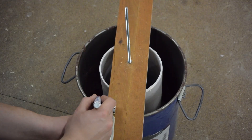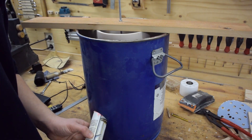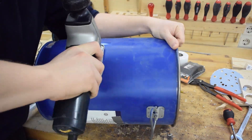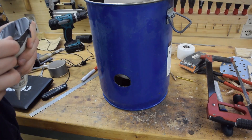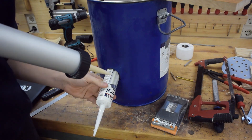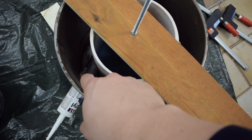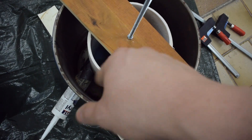For molding the inlet I'm just gonna use this empty cartridge, and now I'm just gonna eyeball where this hole has to go. I'm gonna use construction adhesive to glue this in place. This inlet enters the inner chamber tangentially so that the hot gases are gonna spin their way up around the crucible.